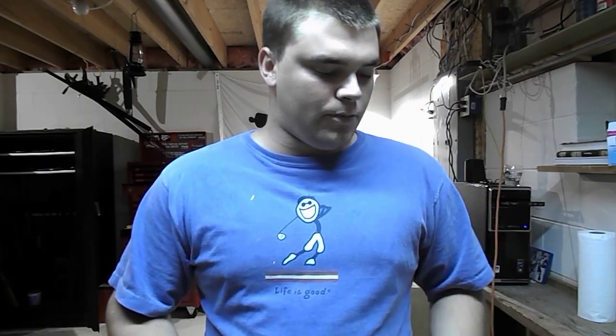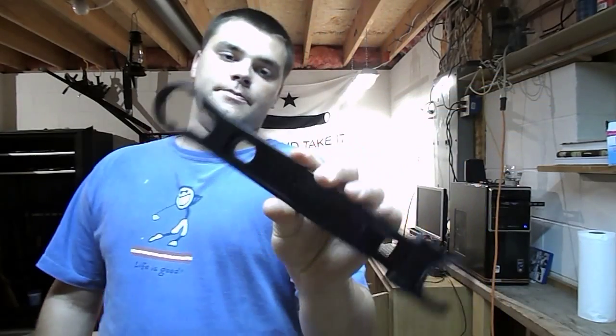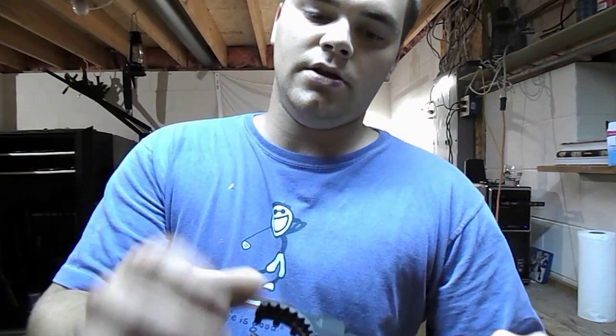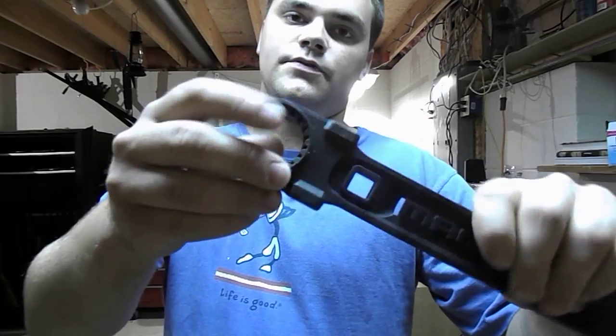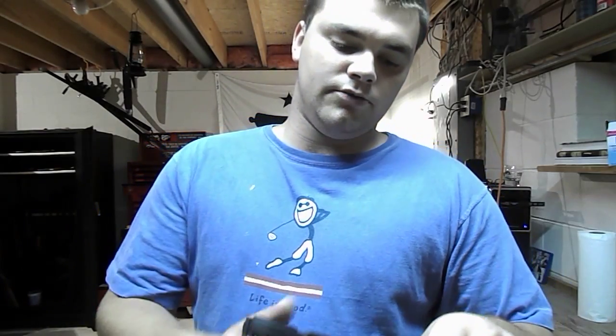A lot of people — and I've had people bring me ARs before — everything was over-torqued and they wrecked the gun. You're going to need a good armorer's wrench. I'd make sure you get one with the standard GI barrel nut and the free-float barrel nut for the two types of barrel nuts you see most commonly. Right on the wrench there.